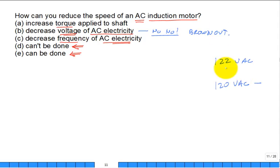But anyway, a brownout, this will drift down. I think they'll go down to 110 volts AC that'll still run. But then it'll get dangerously low, and because it'll burn up a lot of your equipment, both in your businesses as well as your houses, they will not allow a brownout to go. They'll cut it. They'll give you zero. And there'll be a blackout. And then the utilities try to do rolling blackouts. Okay, we killed this subdivision for this many hours. Let's give them electricity. Let's kill this subdivision for a couple hours. That's a rolling blackout. It's managed by the utility.